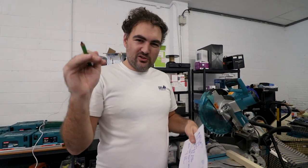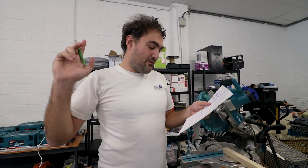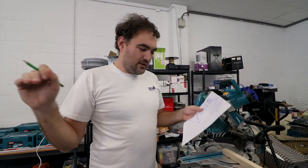The total height will be 49 centimeters on the top of our cushions, including the cushion thickness. Yeah, we hope our cushions will give us 2-3 centimeters when we sit on top of them, so we have a little bit of leeway just to sit down. Our cushions will be 9 centimeters thick. There will be a piece of plywood on top because we want to have something to open up. That gives us 38.5 on the top of the bed frame that we are building now.